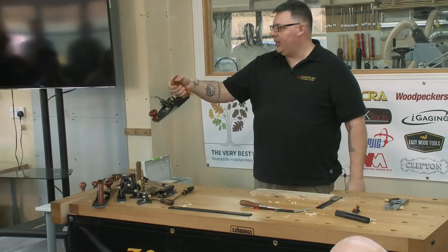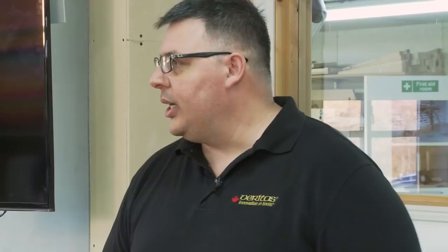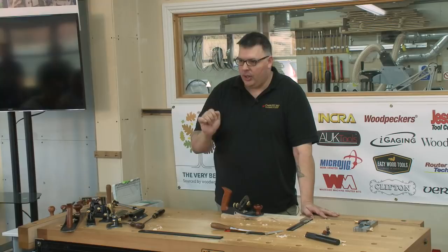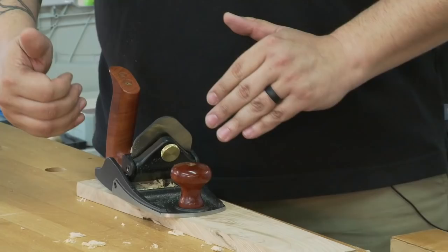Now I've got it cutting in the center. What I'm aiming for is shavings, not dust. If I get dust, something's wrong — typically the blade isn't prepared properly. When treated like a plane iron, you very rarely have trouble getting it to work. It's usually when you've turned a burr that you have trouble, because you have to go from spotting where you're getting the shaving to matching that angle in the body of the plane.